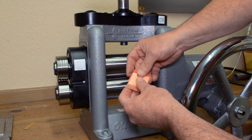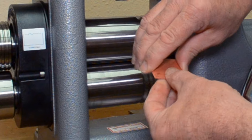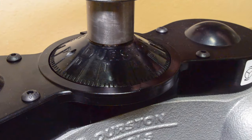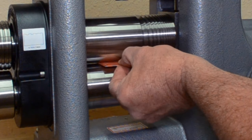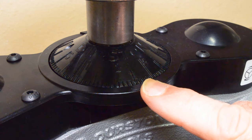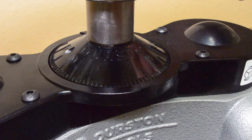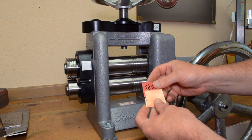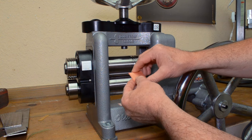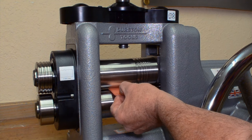What I'm going to do is take the plate out and just the two pieces of metal, and stick them in. I'm going to bring it down until I can't pull the stack out, and read what it says on the dial gauge. Then I'll pull my stack out, bring it right back to that setting, put the plate in between the two, and roll.